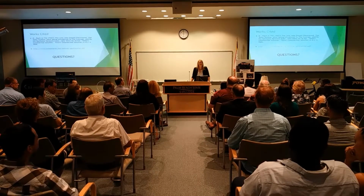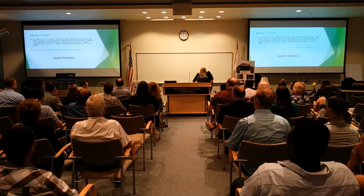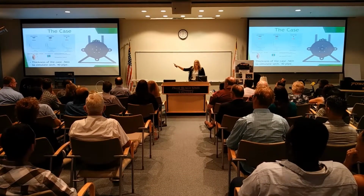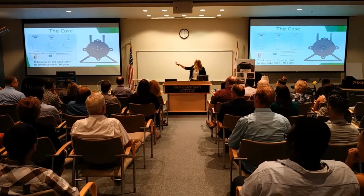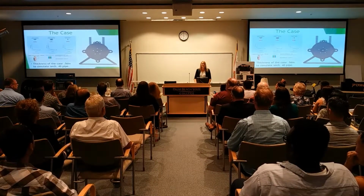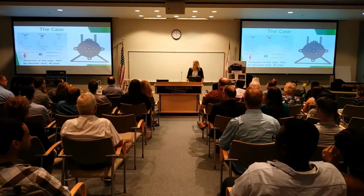Where were the bearings? Were they in the circle of the... Oh, sure, you can go back, I'll show you. In the center there, I made them, the great thing about using SolidWorks is I can make everything nominal on the inside. So the bearings are a tight fit in the center, and they were being held inside there by this little area here. They're just a simple skate bearing, there's nothing special about them. They were just off of a pair of roller skates. So that's the basic design. I just wanted to be able to make a prototype of it. That was very interesting.